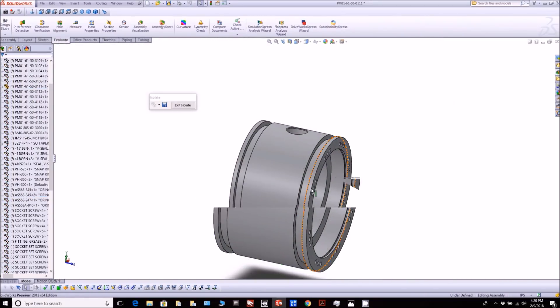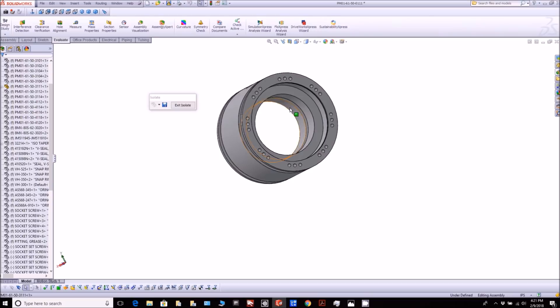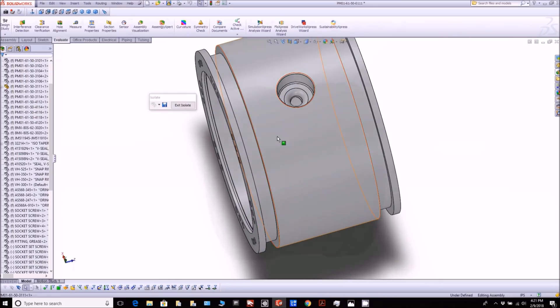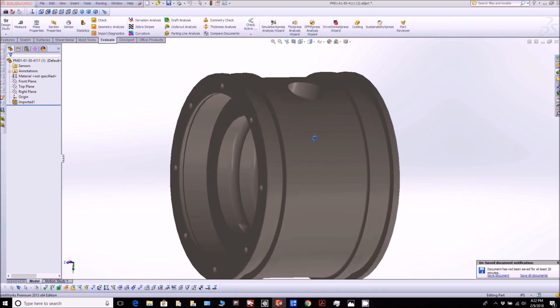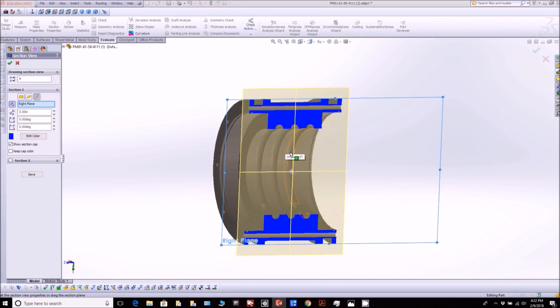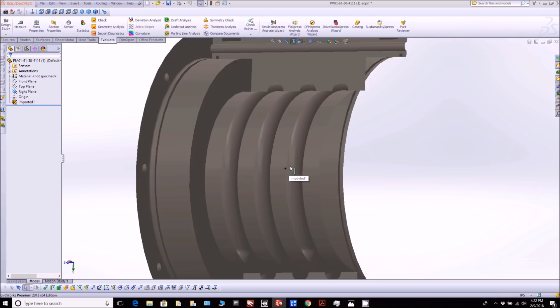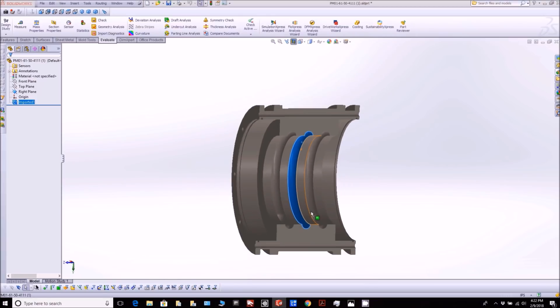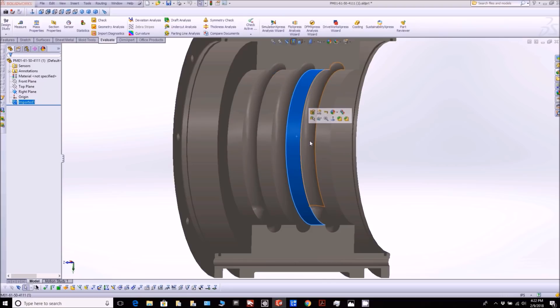We bypassed those by basically blocking off any feed to them with an o-ring on the top. This shuttle was basically designed to just deliver oil into the center of the prop shaft — it has a single channel in the middle that feeds the oil and was allowed to run out to the oil seals. So this is the new design we're putting in now. It has three channels: one center channel that's actually feeding the oil, and from there the oil can split out left and right. This is a cross-sectional view — the oil splits left and right and ends up in the recovery channels, flowing into the channel from that top feed and into the prop shaft through the two holes in the shaft.